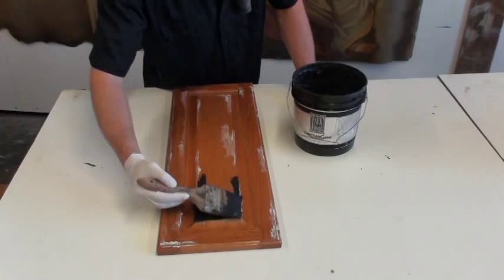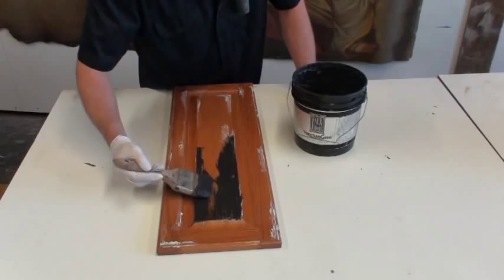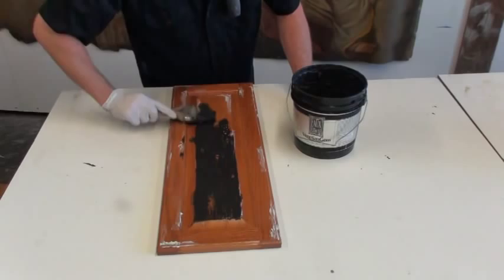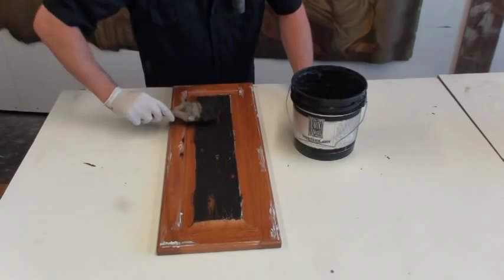so that we can kind of dictate this thing looking rustic. Because I'm leaving some voids on this pass. And in some areas, you're gonna put this plaster on pretty thick, like a little over an eighth of an inch thick, because you want it to look like it's been painted over and over and over. And anywhere that I have size or this cream activator, I'm gonna be sure and hit those areas.